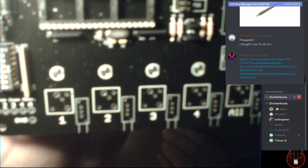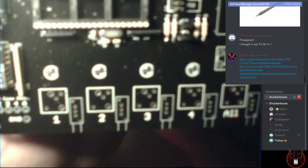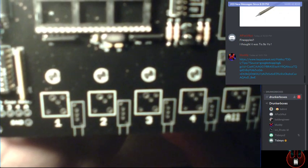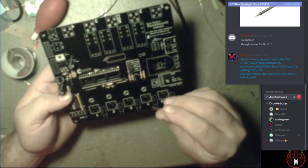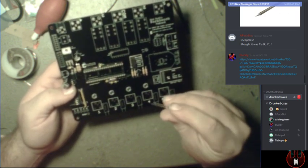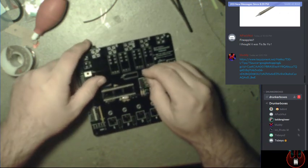What you can see of that, those are the circles with the flat spot for the LEDs. Which one of those is the long leg of the LED? Well, the flat spot is probably the cathode, and as a jerk that constantly cuts the leads of LEDs, I would use a DMM to make sure that the short lead is the cathode.